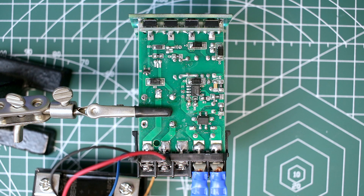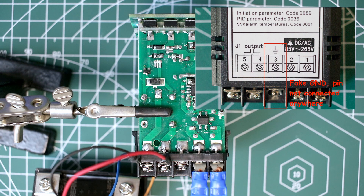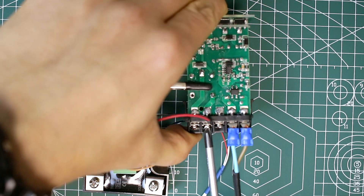I will use the fact that the positive voltage is always on. I will output GND to pin number 3, because this pin is not connected to anything — it's a fake pin.